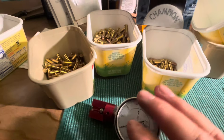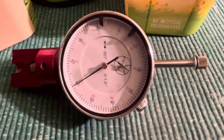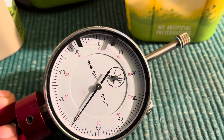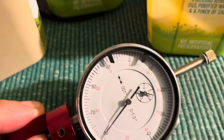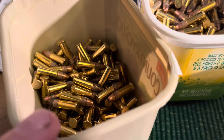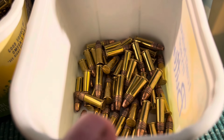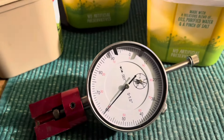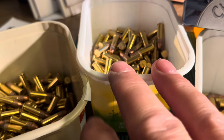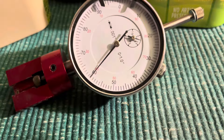What we're doing here is checking rim thickness and sorting for rim thickness. I'm not getting an absolute number per se - I'm just sorting by where things fall relative to each other. Looking at the gauge, we're at about 40 thousandths - it's reading 60 and where the bullets fell was on zero, so this is approximately a 40 thousandths thick rim. This bucket is approximately 39 thousandths, and this one is approximately 40 and a half thousandths. It's just a number - the sorting is to make things more consistent so all the bullets in a bucket are within a half thousandth of each other.